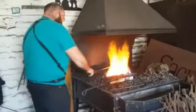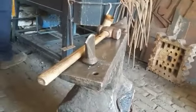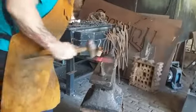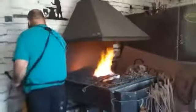Oh yeah, there's a hole through the middle of it — fantastic! So nearly finished, yeah? Yeah. I'm just going to cut it off now. And how do you cut it off — with a big pair of scissors? Not quite. I use another tool that goes into the hardy hole — this is designed to allow me to cut hot metal. It's got a sharp edge. I don't really want to cut it off completely — I just want to cut most of the way through the section so I can then just snap it off.